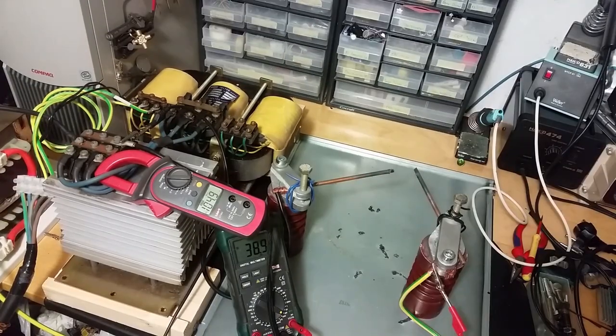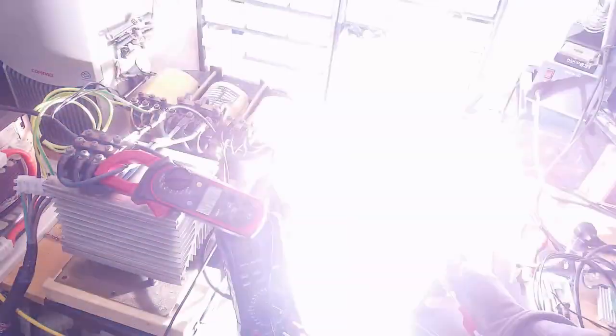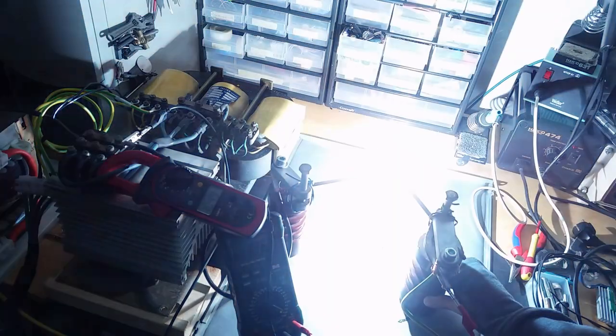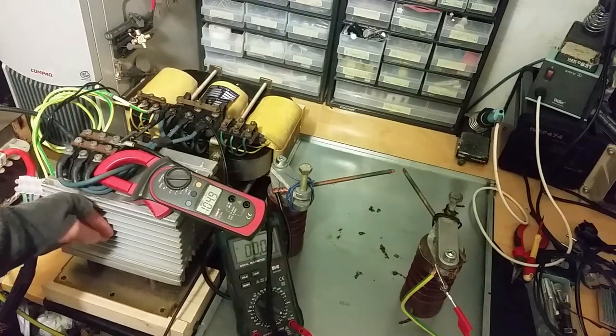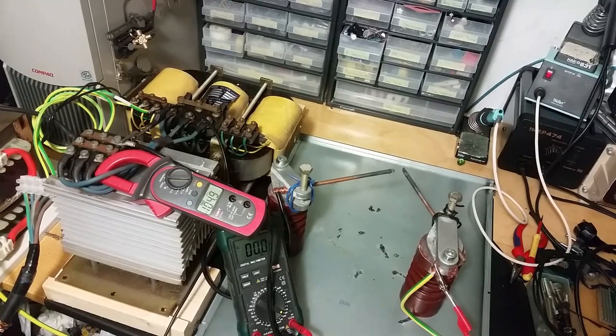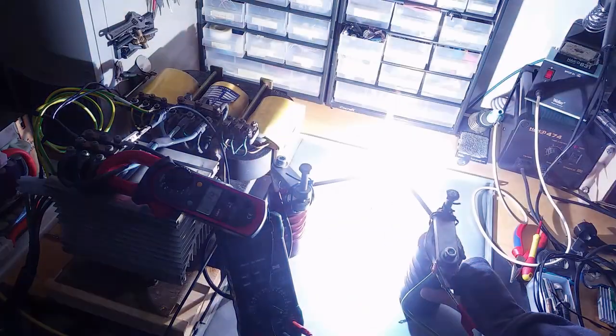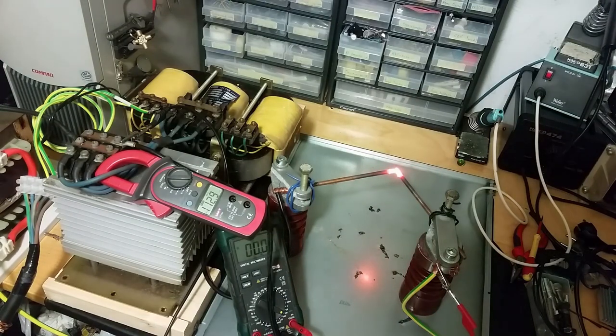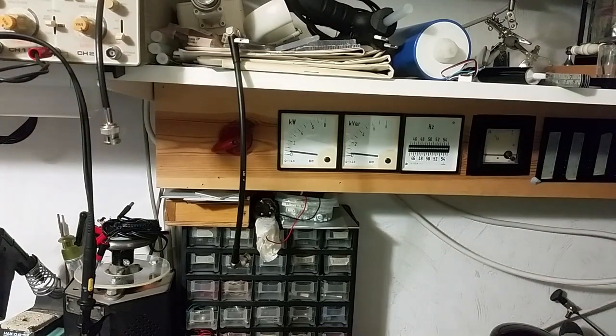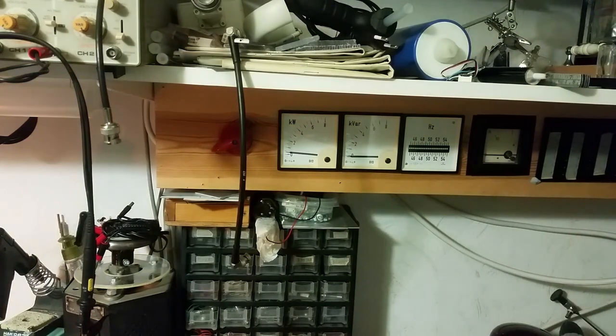Let's try a bit more voltage — 4 to 5 maybe. That is so loud. Need to check the rectifiers — not warm at all. Let's go all in: 50 volts. Still glowing — 112 amps. I think it was 6 kilowatts on the power meter. That's a lot of ultraviolet light. Let's try it with the darkroom.